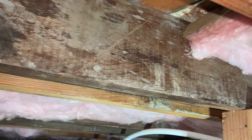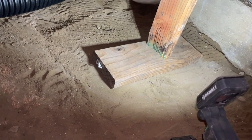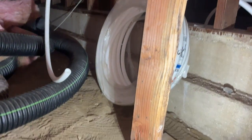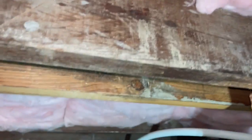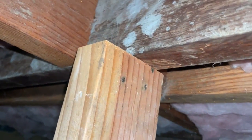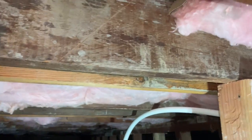We are going to be cutting a floor joist. The first thing you got to do is support it, so I've got a two-by-six scrap wood put on the dirt here — we're in the crawl space. I did that on both sides of where I'm going to be cutting, and then I cut some two-by-four scrap a little bit long, this happened to be 29 inches, and hit it with a hammer. So now it's pushing up on this side as well as this side, so that when we make a cut, the other side will still be supported — otherwise it would fall down on us.